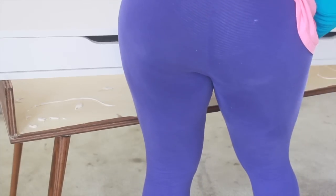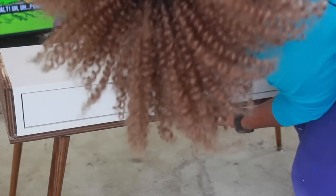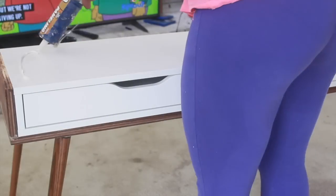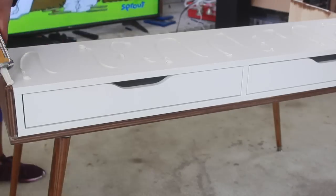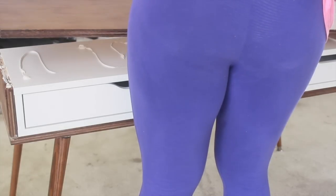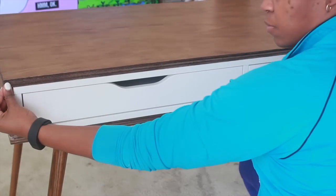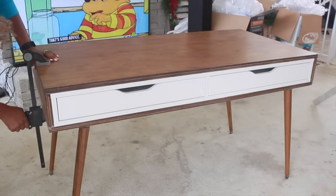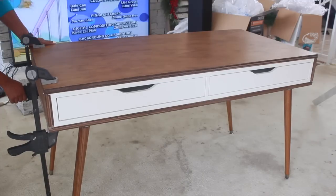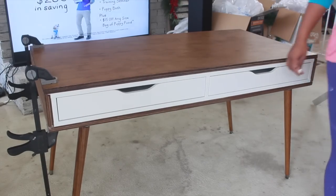Now it's time to put the shelf inside. I used liquid nail to secure the shelf into the inside of the desk cavity. You slide it in there and make sure it is nice and even — you don't want it off even a little bit because it just looks funny. Then take some more liquid nail, put it on the top, and also along the edges of the shelf. You're going to put the top on. If you had a brad nailer this part is already done, but with liquid nail you take clamps and clamp down both sides. I ran out of clamps so I had to do it one at a time. That's basically how the desk is put together — let it dry.